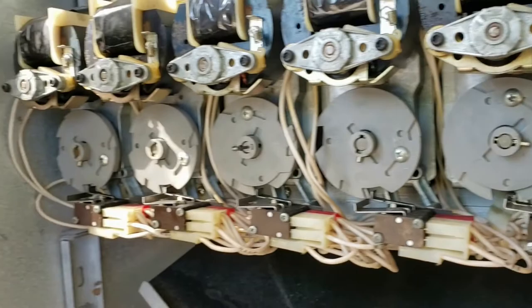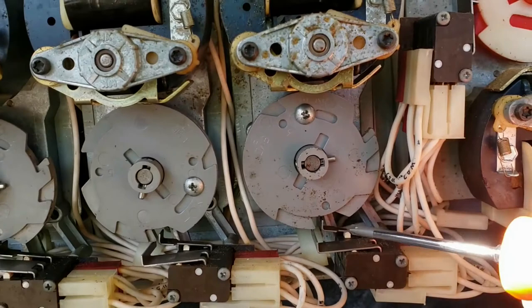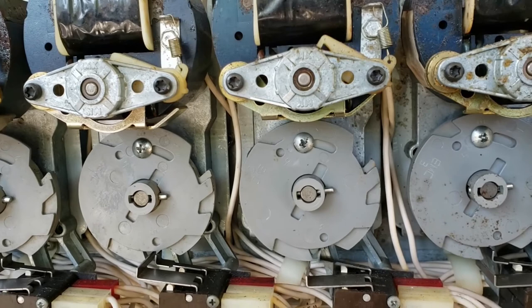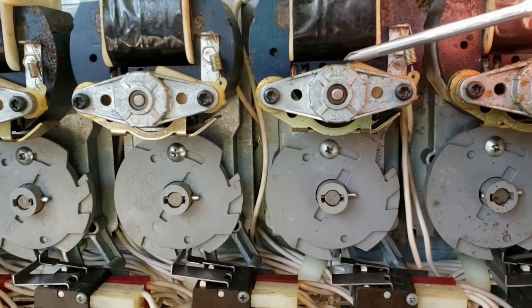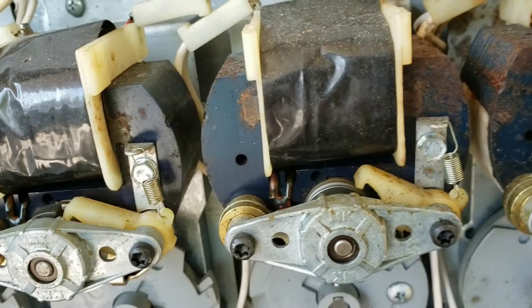That one's number four. All the rest of them are resting where they're supposed to be, except it looks like number six has the same issue. The way these are supposed to work — I know number three works so I'll show you that one. When you push down the micro switch, it rotates all the way through its cycle, and then the micro switch falls back into the next channel and the macro switch stays up on the lip. You've got this motor turning and a park gear that clicks in and stops it from rotating when the micro switch falls into the channel.